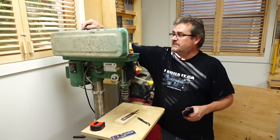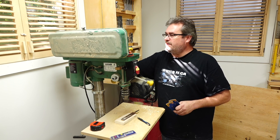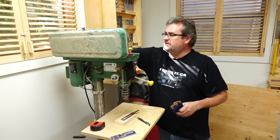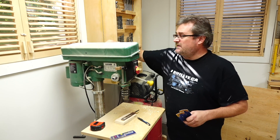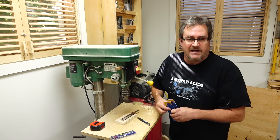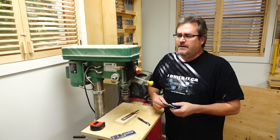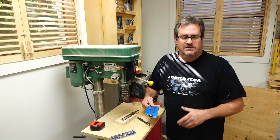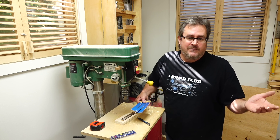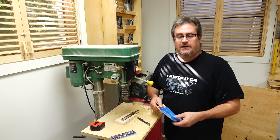I'm not sure about the RPM — I never change this, it's always at the same speed. Looking at it, it reads C2, which is 680 RPM. So that's not a very fast speed. But apparently it's too fast, in a lot of people's opinion, for drilling holes in carbide. There were also a lot of comments about the lubrication I use — I should have used water, one guy even said to use beeswax. I don't have beeswax, I have oil and water, and I'm not going to go out and especially buy something — although I did today.